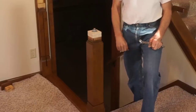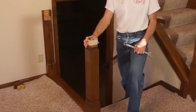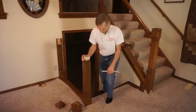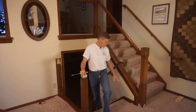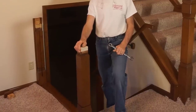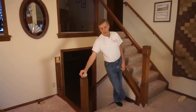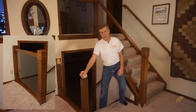Once the bolt is snugged down, the post just vibrates from the tension in the rod, but that's pretty much flexing the post itself and not the anchor system. It's not getting looser with the movement, and I think that qualifies as rock rigid on a freestanding post like this, especially compared to other post anchoring systems like small brackets or plates screwed to the floor. The other two posts have structural advantages — the stair base post has a small knee wall for sideways support, and the landing post has railings coming in at angles — so this freestanding post was the better demonstration of the strength gained by the ready rod anchor system. If I push hard enough it'll flex, but there's no notable movement leaning on the post, and once the top handrail is installed the only force influencing it will be side to side, and there's plenty of strength for that.